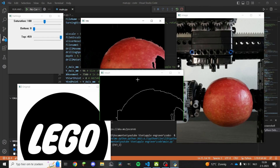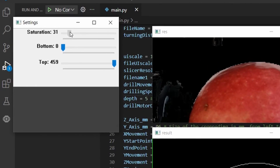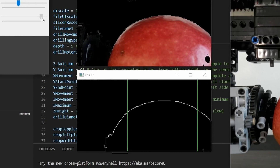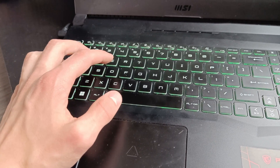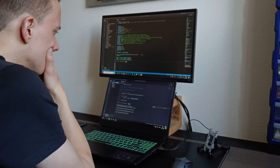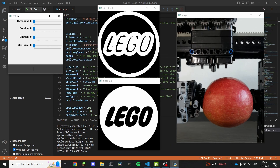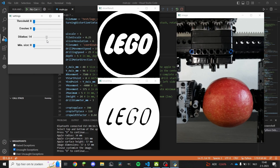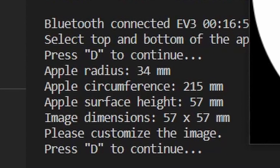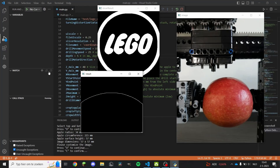The first thing you need to do is specify the image you want to engrave. Then you use this slider to select the apple. Next we use these other sliders to tell the robot where it should engrave the specified image — this completes phase 1. When we press D to continue — don't ask me why it's D, I think the very first tutorial I watched used D and I just stuck with it — we get a few new windows in which we can determine what the image is actually going to look like. The machine calculated some dimensions so that the preview is actually on the right scale. After messing around with some sliders, you hopefully get a result you're happy with, and you press D again to go to the next phase.